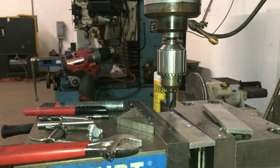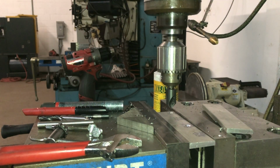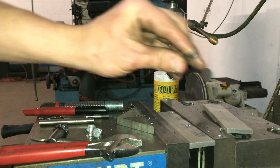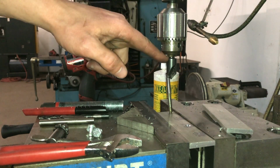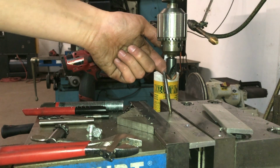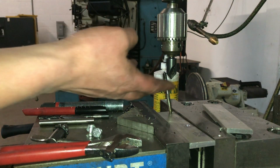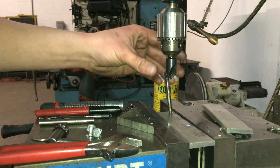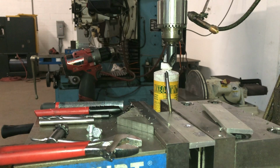So now to do these tapped holes that I should have already done, like I said, I'm just lining up the holes with the drill chuck with the countersink. So I got it pretty close. Now, I'll admit it, I'm younger than most of my coworkers. I used to be stubborn. I used to put the tap in there, and my tap comes to a point on the end. Well, the ones that don't, the ones that have a divot, I'd put the tap in and I'd take the countersink and I'd touch it in the divot and I'd hold it in there. And they kept trying to tell me that you'd dull out the tip of the countersink because one's a softer material, one's a harder material. And the harder material of the tap is gonna wear out the sharp tip of the countersink. And it took me a while, but finally, I got over my stubbornness and listened. So always listen to the older guys because they always have stuff to teach you. You never, ever stop learning.